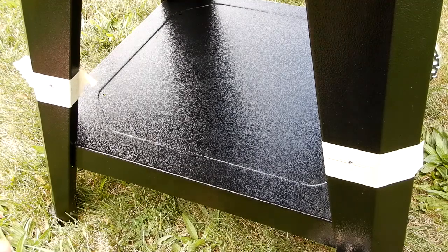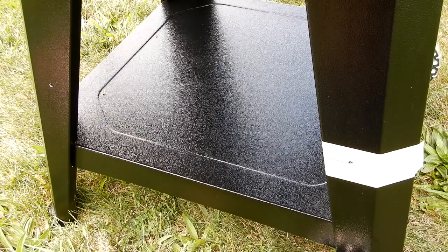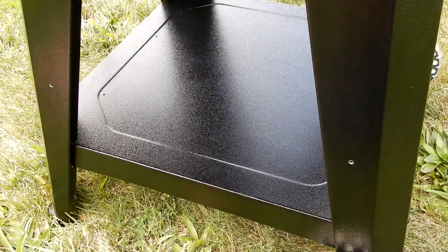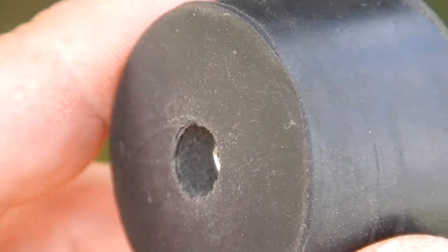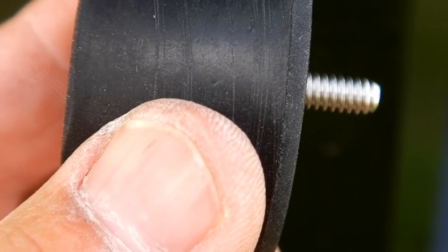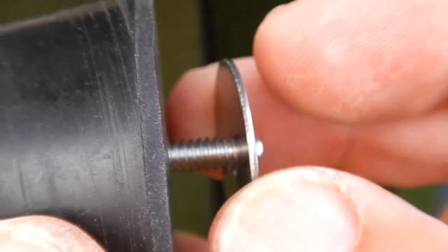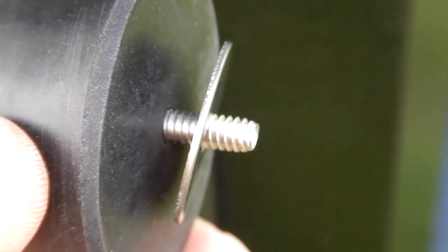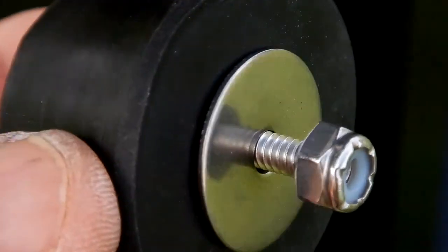Those bumper holes are drilled — only 3/16" this time. If you're using the same 10-24 or 3/16" bolt, only drill to 3/16". To anchor the bumper, we're using an inch-and-a-quarter by 10-24 (3/16" diameter) bolt. Put it through till it bottoms out into the leg hole. On the back side of the leg, put an oversized one-inch outside diameter 3/16" washer, then a nylock nut. Heat won't reach this far down so no extra lock washer is needed.